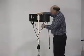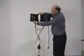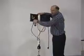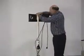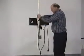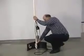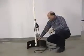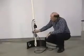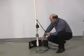What we would do to service the system now, we always have a coil of excess wire here to allow us enough room to be able to pull our float tree out. So I'll detach that from our J-hooks. At this time I can unsnap the float tree, and I can actually pull this float tree right out of the system. I'll snap the pipe back into our float tree bracket, holding all our pump floats and sensor floats above the surface of your riser.